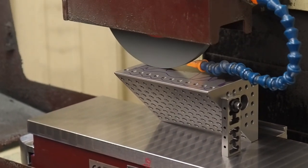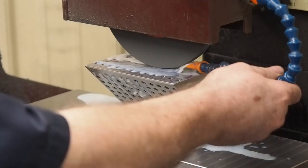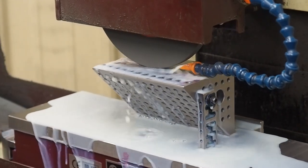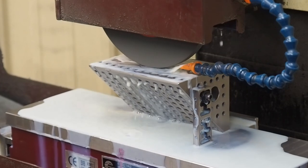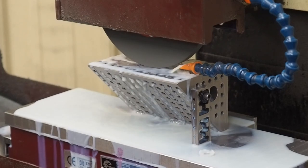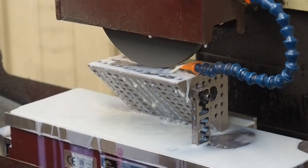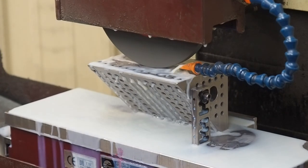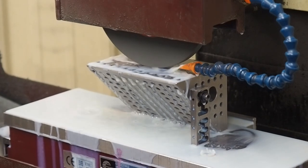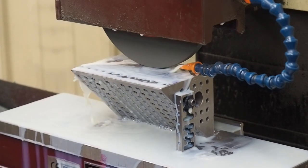What I'm going to do is get the coolant going, cool the part down, cool the magnet down. It was running in the background earlier just to keep everything nice and cool. When you're doing this precision grinding and you're shooting for extremely tight tolerance, you want to keep as many of the variables the same as you can, and temperature will be one of them. That's where coolant comes in really good for projects like this.